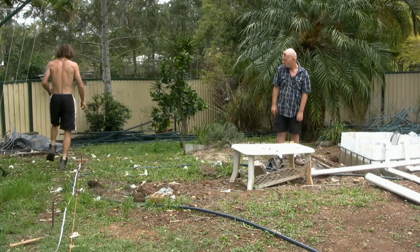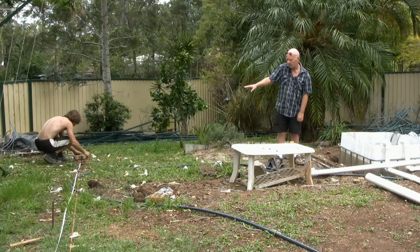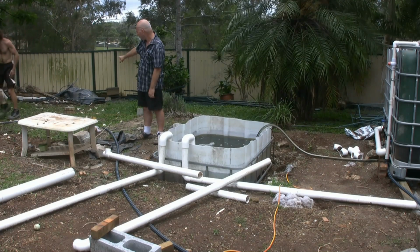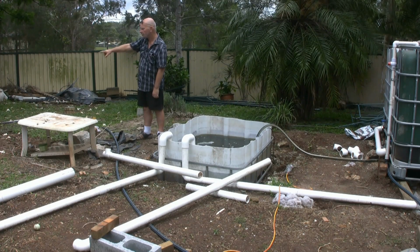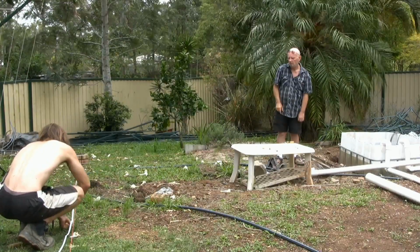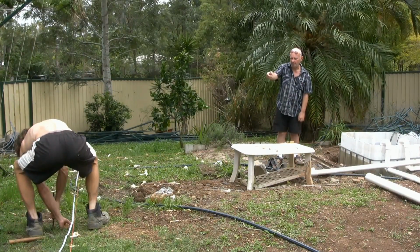John's just weighting the tape down there so that it can't pull through as it gets his measurement. And he'll just make sure his tension's on the tape nice and even. And he's made sure his 0 point is on the tape at the corner peg. Just pull it straight. And we'll just the peg over there that he had. He's got to come in again about 75 mil.